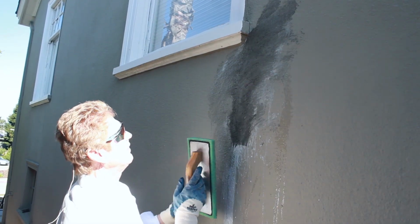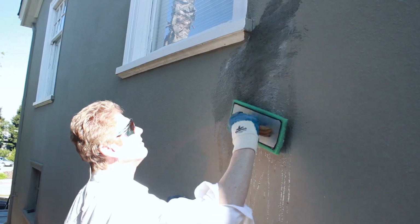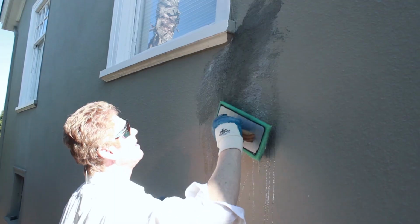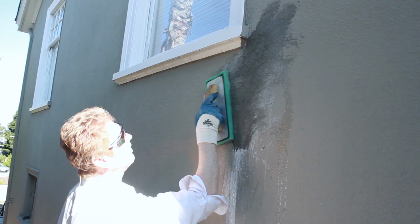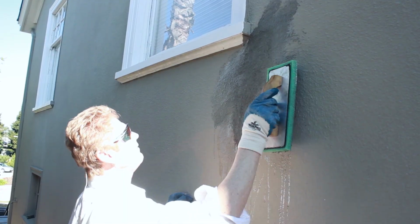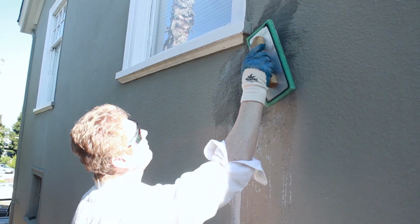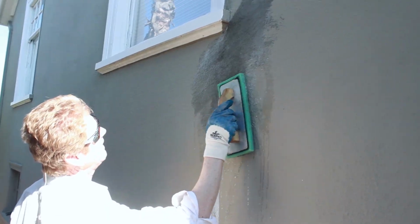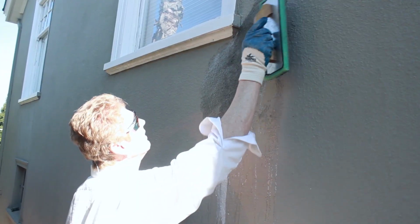Just have to know your materials, know your cements and stuff like that. And I'm telling you, rather than use Portland cement where you got to add sand, just buy a bag of the Rapid Set stucco. You can buy that stuff almost everywhere now. Used to be you could only buy the Eisenwall, which is a sister product, in plastering yards. This stuff, the Rapid Set stucco, you can buy anywhere. It's at Lowe's, Home Depot, even the little bitty hardware stores. I got this at Economy Lumber in Oakland, where I buy little 10-pound boxes for little things.